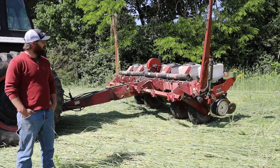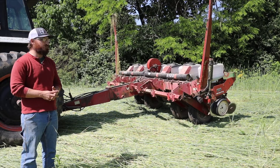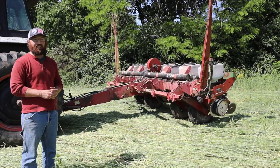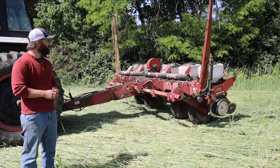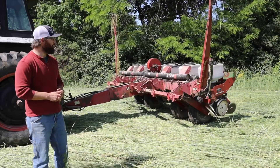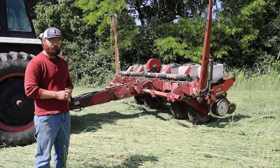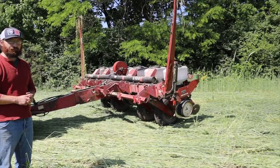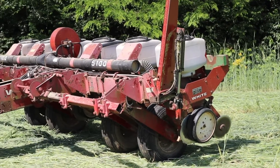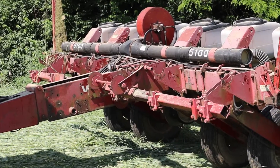To have it run into the rye, we always keep good blades on it — that's probably the most important thing. We don't run any no-till blades; we found that no-till blades just keep it out of the ground more than if you just have good opener blades. On the White 5100 we don't have a good option for heavy down pressure springs — it's a rather lightweight unit. So we took the insecticide boxes off the rear and added John Deere combine weights off an old 6600 John Deere, two per row. That does a very effective job of slicing through the rye, though in really heavy spots we'll occasionally have some trouble with cutting the residue.